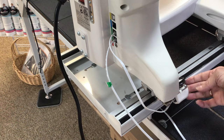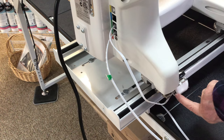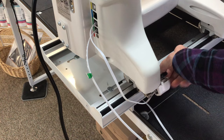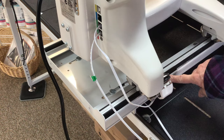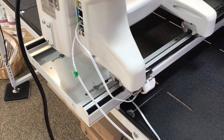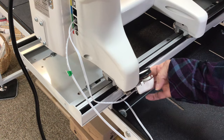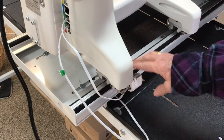Plug the connection back in here and also down here. What he means by the O-rings — some have an O-ring, some just have a rubber ring of some sort; they can be replaced. Also check and make sure your tracks are clean. We clean ours weekly; the machine we use every day we clean every day. Make sure you don't have lint, threads, or anything wound up inside your encoders. Check the spring action too — that should take care of long stitches.